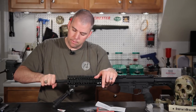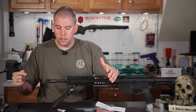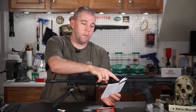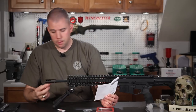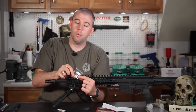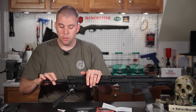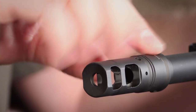Let's say for the sake of argument it stopped and was cocked off. We would sight down the front of the barrel and see how many degrees off it is. Then we grab the timing wheel, make sure we're on the page for 24 threads per inch, and we can see that at that angle we would need a red shim and a no-color shim. We'd take those shims out, back the brake off completely, slide the shims onto the threaded portion of the barrel, screw the brake back on, and snug it down — and it should come up right where we want it with those shims installed.